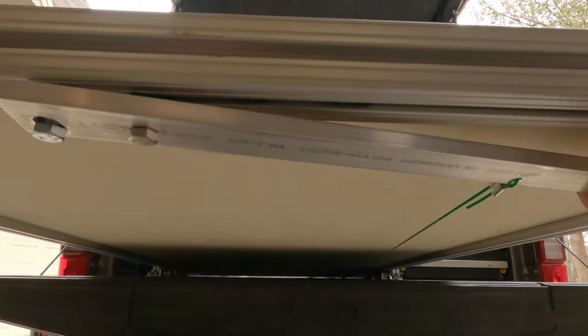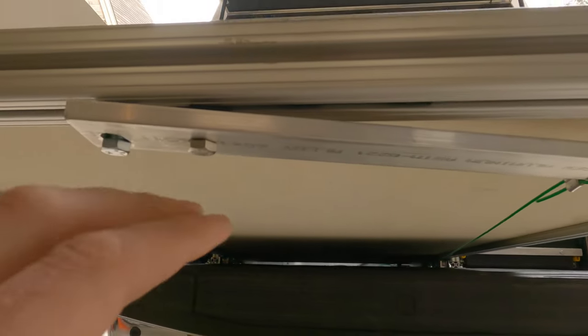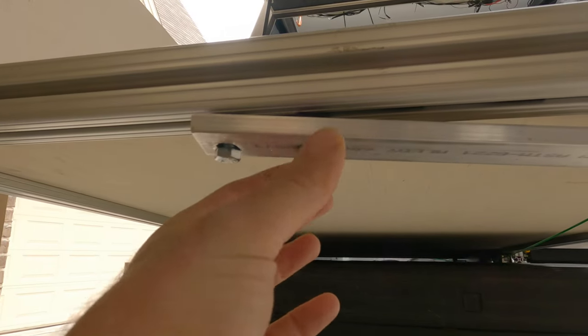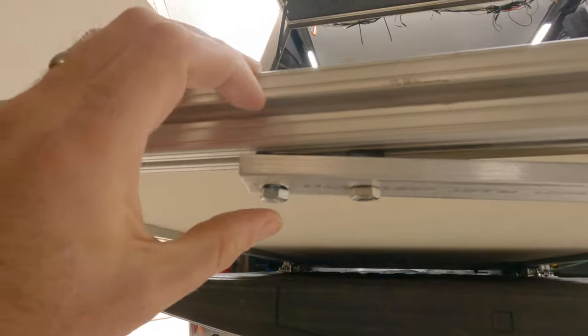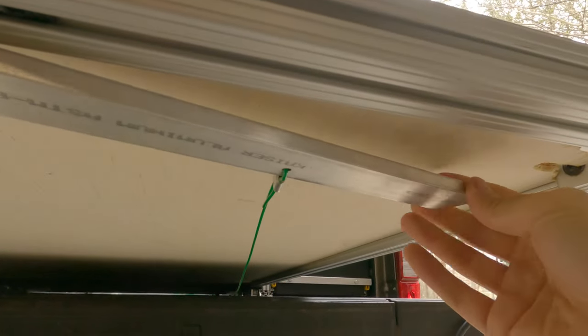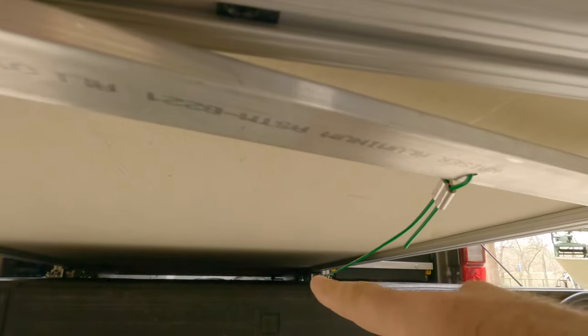Here's the handle mechanism: I have one pivot point pin and another — this bar can slip around but is mounted rigidly to the 8020. The other one is mounted the same way but has a longer slot milled out of the aluminum bar, giving a controlled amount of movement. Then I have a steel cable mounted to that triangular piece of aluminum, giving a fairly simple spring-loaded pin mechanism. I need to make some refinements but the basic design works.